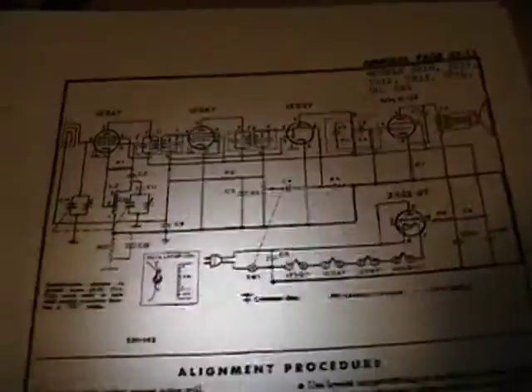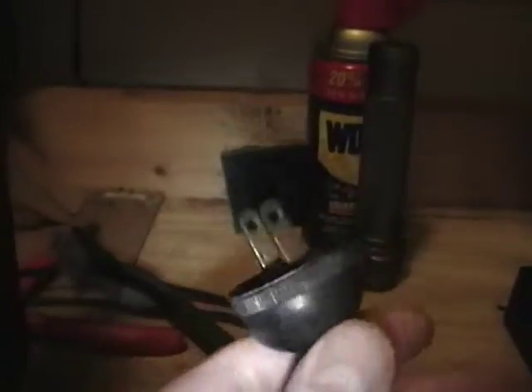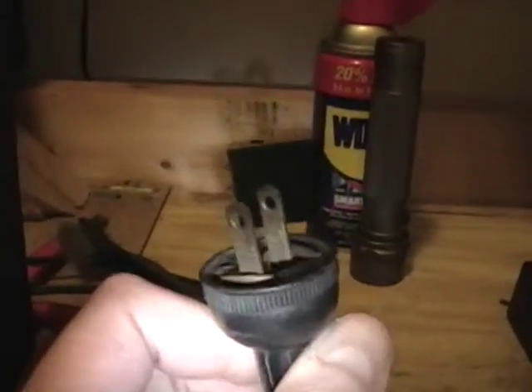In this case they didn't separate them — I'll show you here. This is the old AC plug, unpolarized, meaning you can plug it in either way, so you have no idea which of these two lines is hot and which is neutral. One line comes into the radio and goes directly to the rectifier tube along the top path. The other side goes to the power switch, and the other end of the switch goes directly to ground — meaning when you turn the radio on, this entire metal chassis is connected to one end of the plug. Depending on how you plug it in, it could be neutral or it could be the hot lead. That's why this doesn't get a UL rating — it's a very dangerous thing.